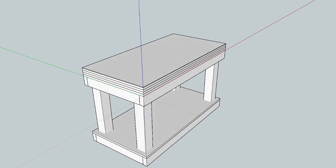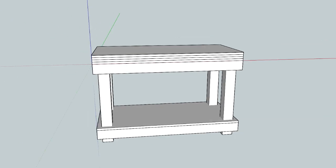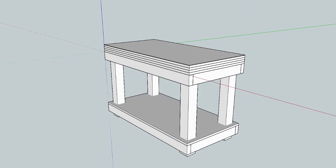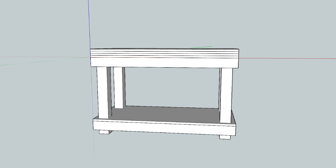What we're going to do here is show you the 3D model of the actual workbench — how it's going to look when we get it finished. As you can see, it is 48 inches long by 24 inches deep and 33 inches tall. That's about an inch and a half shorter than a normal workbench because I'm going to be putting leveling feet on the bottom since my garage floor is not totally level. 4x4 legs, 2x4 frame, and then 4 pieces of plywood to make a 3-inch top, plus a sacrificial hardboard for the top, and an MDF shelf.